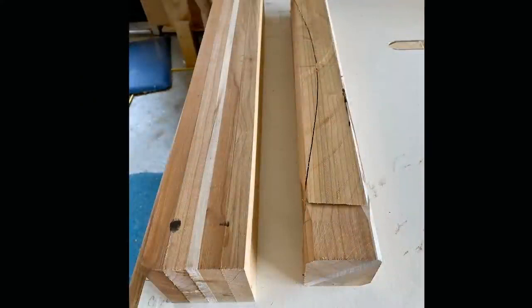So I had this idea of something different for the legs, so I'll try and explain how I did it. I milled some leftover cherry that I had in stock to 3/4 inch by 4 inches wide by 24 inches long. So roughly, guys, that's 19 mil by 102 by 610 millimeters. And some maple to 3/8 inch, 10 mil, by 4 inches by 24 inches, and glued it in between the four pieces of the cherry, two on each side of the maple, as in photo one. So what he's got there is that lighter piece of timber in the middle.